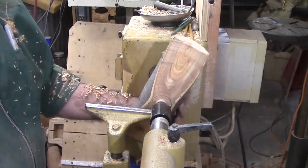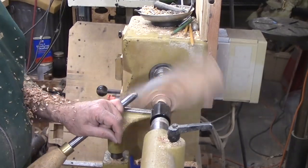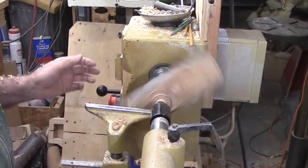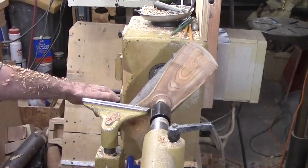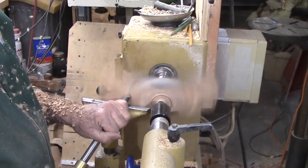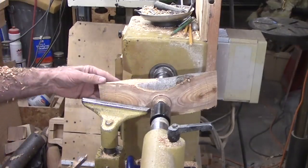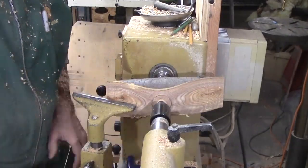I've turned up the RPMs pretty good. It is fairly balanced despite it being a limb. I'm approaching it with my large bowl gouge. I'm starting by cutting from the live center out. This is side grain and the wood is still green, so the wood cuts away nicely. As I get under the bark, I notice both open and filled wormholes. Filled wormholes are filled with — what else? — worm poop. That's okay; some of the best bowls have wormholes.